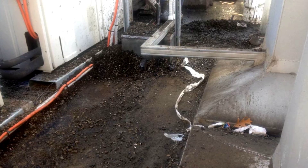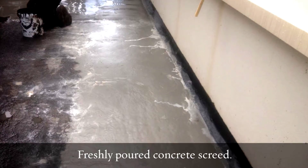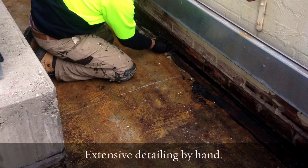That got rid of everything, and then once the deviations in the floor were grouted up with a flowing grout, we leveled up the floor surface and made a reasonable surface for waterproofing.